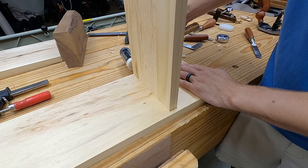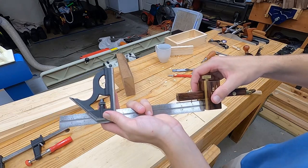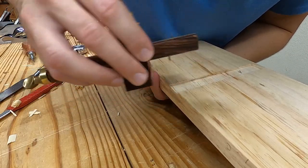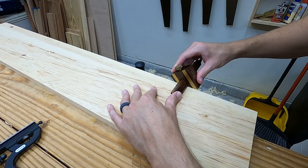Test fit into the dado, but don't mark it yet. I ended up cutting off my letter A. I gauge one inch from both edges on the inside, and after penciling the walls from the front edge knife nicks, I do the same gauge lines on the front.